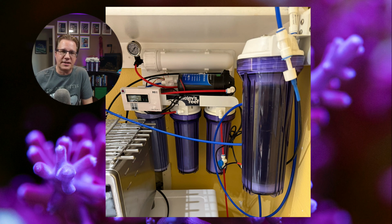And 14 TDS going into my DI would wear out the DI more quickly than when the water's coming out at 2 or 3. That nice low number going into my DI makes the DI resin last a long time, and that's why I bleed off that first 90 seconds so I don't even get that burst of 100 to 150 to 200, that 1 minute's worth. I don't even want that 1 minute going into my DI.